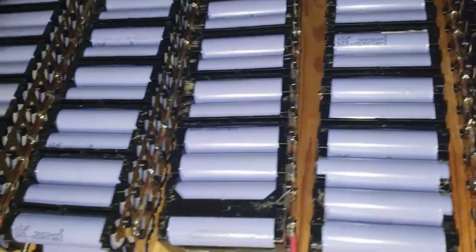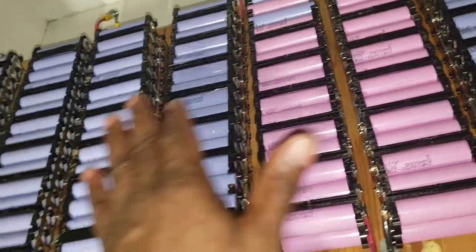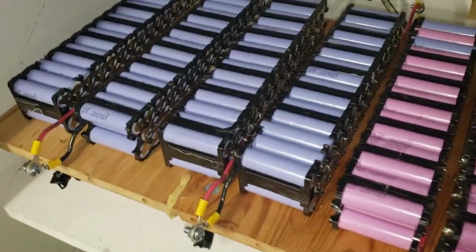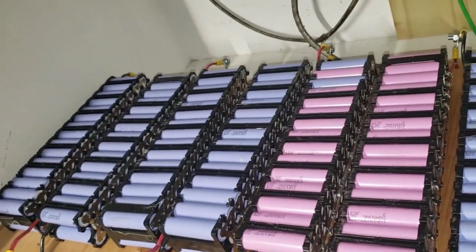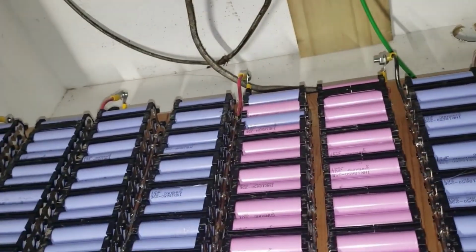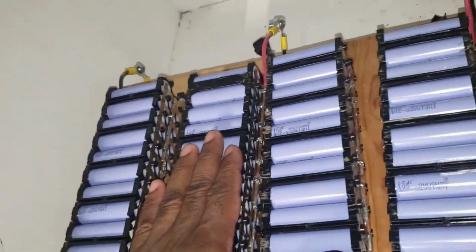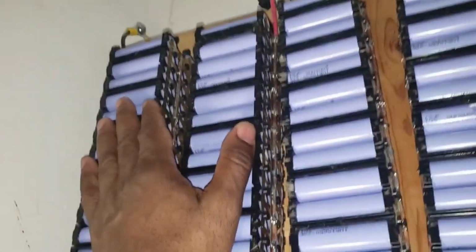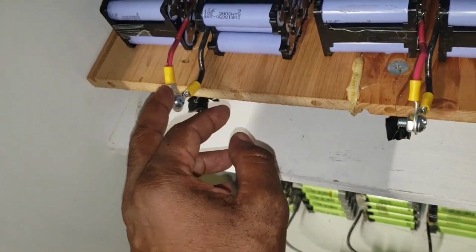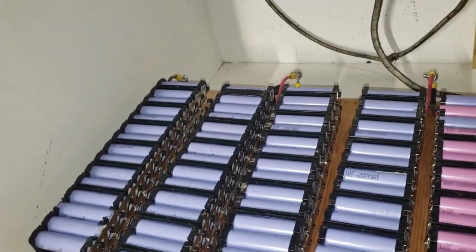Okay. So each time I add the batteries, I keep checking the voltage for each battery. I remember somebody was working for me. I told them to do that. What they did, they placed all the batteries, then they started tightening the bolts. Earlier, I had 2 positive in here. If I only plug 2 positive, that will not make a big deal. When I plug the next battery, it will be a big deal. So this is why you check it. If I have 2 positive in here, when I check this cable, I will have the exact same voltage down there, so that would be wrong. I explained this to somebody, they weren't listening, so they broke my battery.